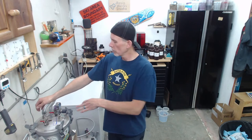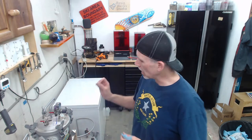Liquid Diamonds is an epoxy, so it cures on an even time scale — it has a 7-day cure schedule. I wouldn't recommend turning these for a full week ideally. I'm going to cut them up in a few days and turn one, but you're better off letting it fully harden. What ends up happening is you have a very small amount of resin around all the pencils at the joints, so the longer it has to cure, the better off it's going to be.